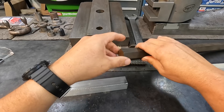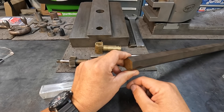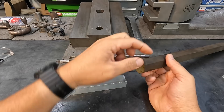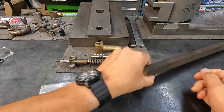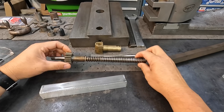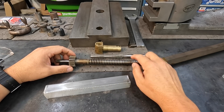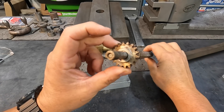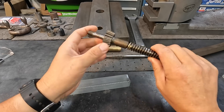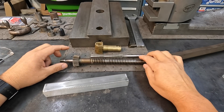I've got this piece of bronze material here. I don't know the exact grade, but it's something my dad had in our shop, probably used to make a lot of different types of parts. It's a hex piece that we can use to make a test nut. Once we get that machined, we're going to start machining our new lead screw. I have a piece of stress proof material for that. Also note: the gear is a separate component that's pressed on with a key — we'll press that off before machining the new lead screw.